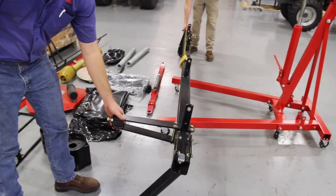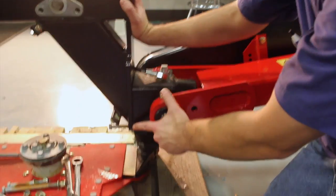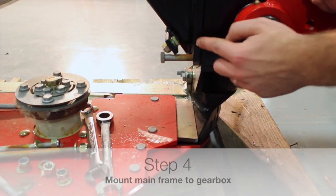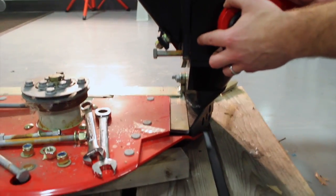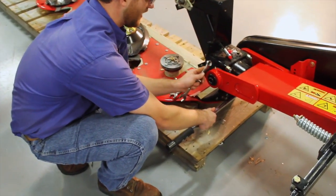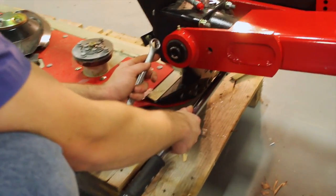We have the backbone suspended with a hoist. We will lift this up, set it down, and bolt it onto the mower. We're in the process of bolting the backbone onto the gearbox. This bolt needs to be installed into the backbone first thing before you begin mating the two together, or else you run into a clearance issue with this little bracket. I'm now installing the bolts that bolt the backbone to the gearbox, torquing these to about 81 foot-pounds.